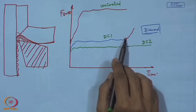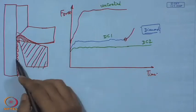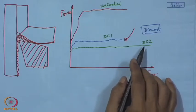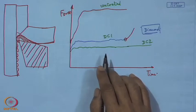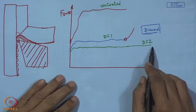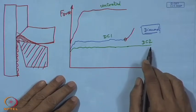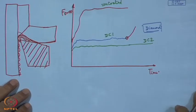After coating rupture, aluminum gets stuck in the exposed area, causing force to rise, and redeposition of aluminum on the workpiece increases surface roughness. With a coating of better adhesion and better smoothness, not only does coating life increase due to good adhesion, but the lower drag and sliding force also reduces the risk of partial coating removal.